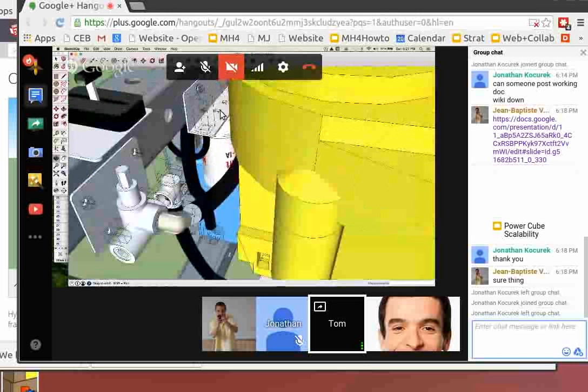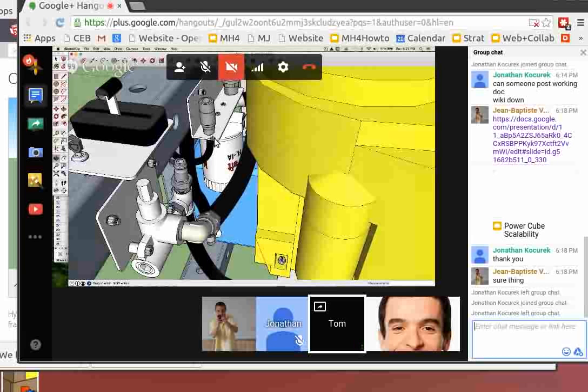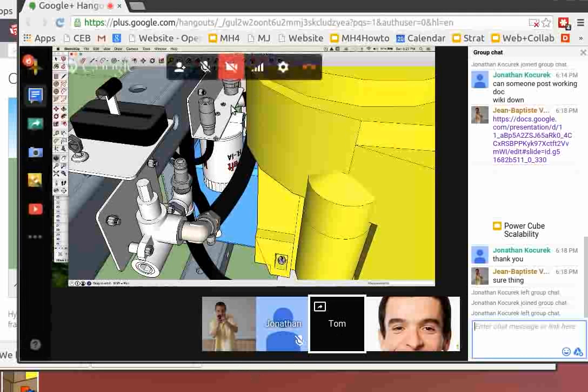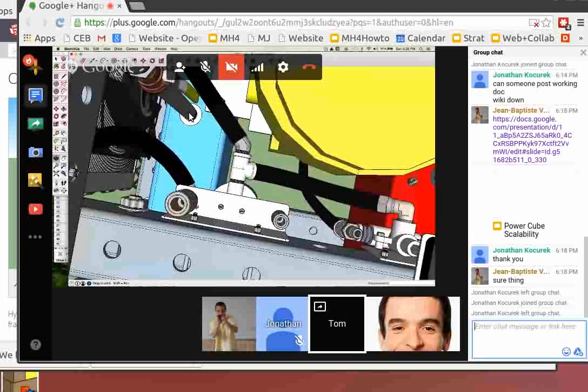This one, I tried to get this shelf to be like a 2x2 angle iron. It just wasn't working out, so it's about 3 this way and about 2 over. Probably what we want to do for that is, if we assume we have the torch table, do that from 1/8-inch steel and then just perforate it and bend it. Because you've got the holes too, right, that you need to do. Yep. And actually, the holes for the filter are relatively precise. The torch table would help a bit there to take that to no fabrication time. Otherwise, if you're drilling or torching, you've got 6 holes there.